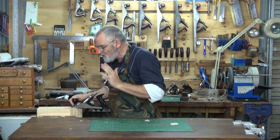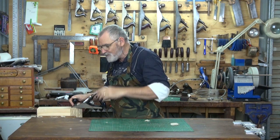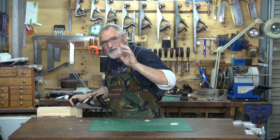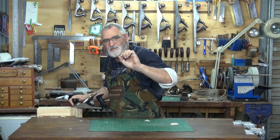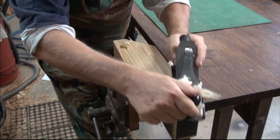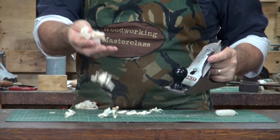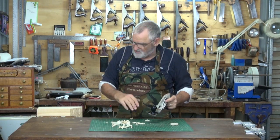And you can hear that's taking quite nicely. I have got some ridges here where it didn't quite line up, so when I go over those you'll hear the plane doing hit and miss. When we get a nice smooth sound the whole time, then we know we've got it flat. Just a little glue line there, and then nice shavings. You could make them a little bit finer, but in this situation that's fine.